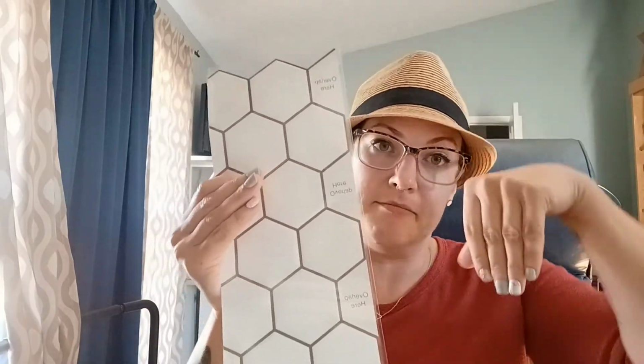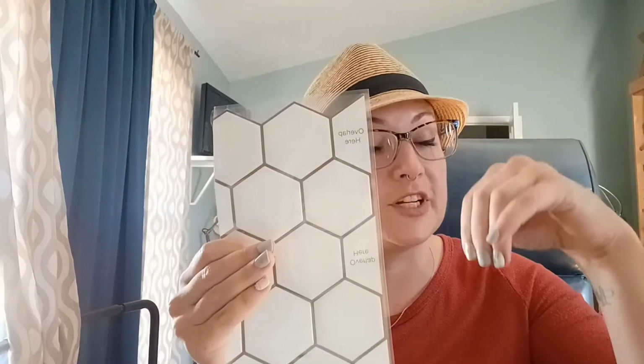So when you're going to cut for the first time, your first cut when you're putting it up on the wall, make sure that you have a straight edge for both areas. If you're starting at the ceiling and the corner wall, you're going to want to make sure that your straight edge is on the ceiling and also along the corner wall, and that your overlapping edges are going to be facing out and down. So if you're starting at the bottom and working up, make sure that your straight edge is going to be at the countertop and the opposing wall or wherever your finishing is, and then the overlap will be on the top and the side that you're going to be working off of.